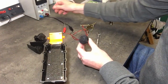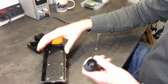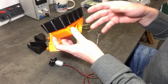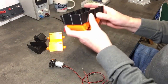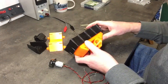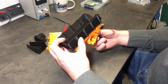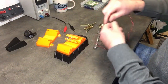Yeah, I think that will work. You'll have to keep track of the orientation or rotational direction, because this is an asymmetric vibrating device. There is more acceleration in the vibration in one direction — that's what's going to push stuff in one certain direction. But that's easy to adjust.